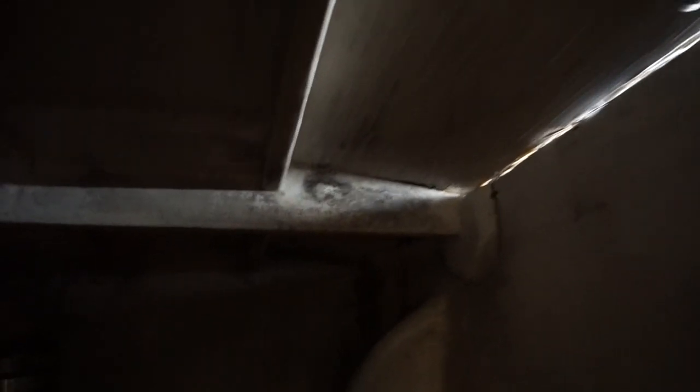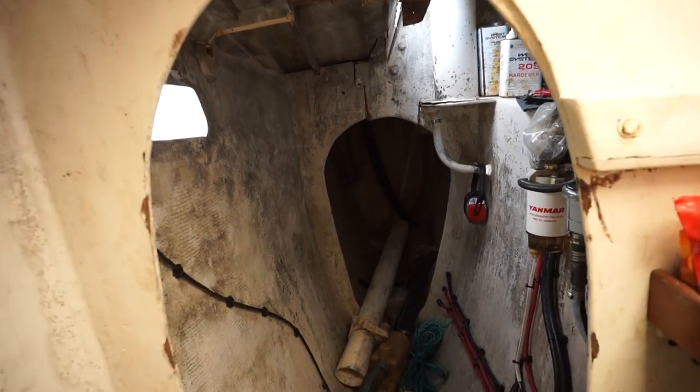So here's that same deck but this time from inside. That's all broken and delaminated. This stringer, surprisingly, is not broken — but I guess it doesn't really hold a load. This decking is all separated all the way back here. This is broken. That stringer's gone.